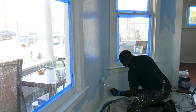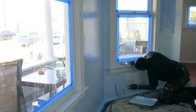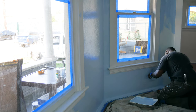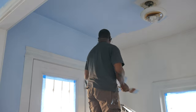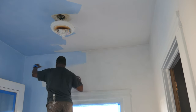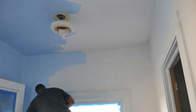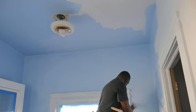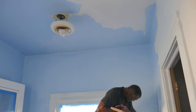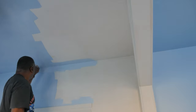Once I get this color on, I'll come back and do the second coat, then get ready for the trim — which also needs two coats. It wouldn't make sense to do two coats on the wall and only one on the trim. Painting is not for the faint of heart; you have to have patience. You can't apply paint too fast or it will run, and you need a little drying time between coats so the first coat is tacky enough for the second coat to stick.